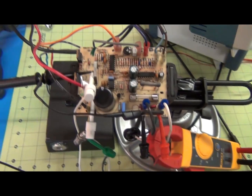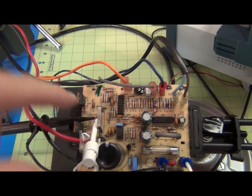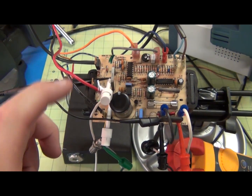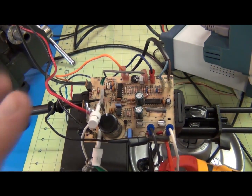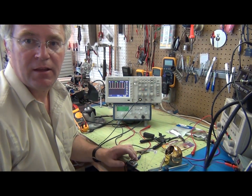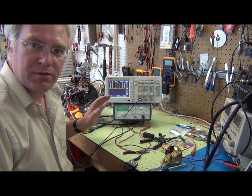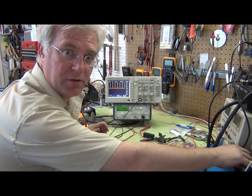What we've done is essentially taken pin 6 of that pulse width modulation chip off at the two resistors that feed the two transistors, and jumpered them together with the function generator along with the scope so we can watch it. This time we shouldn't be drawing the function generator to ground with that chip anymore and the motor should work. We have that same signal coming out of the function generator injected into those power transistors now, so we're ready to give this a shot. I'm not going to run it very long though because normally there are heat sinks on these power transistors and bridge rectifiers, and all I have is my little fan.